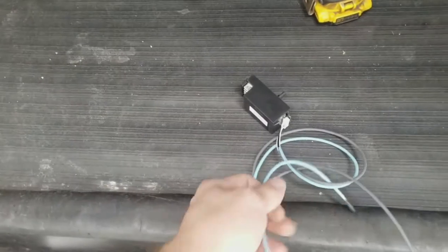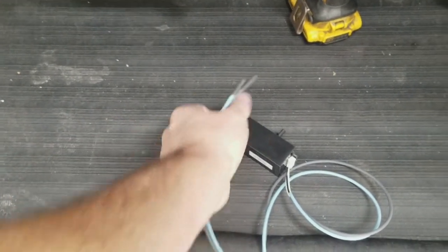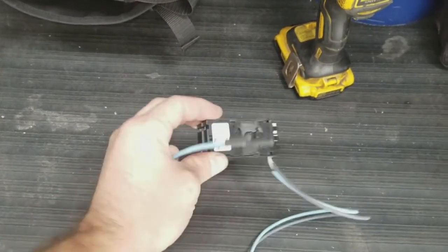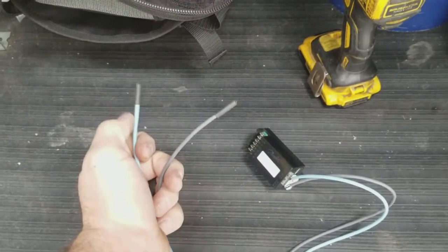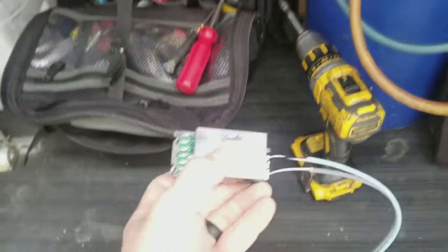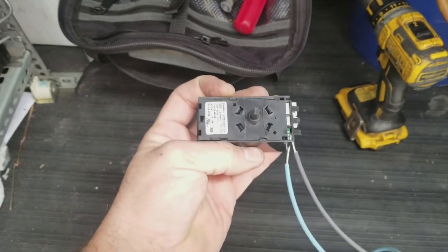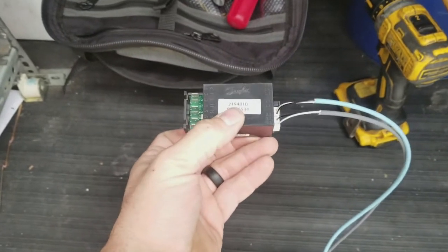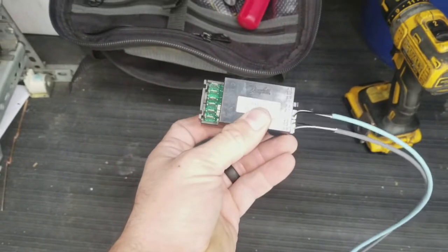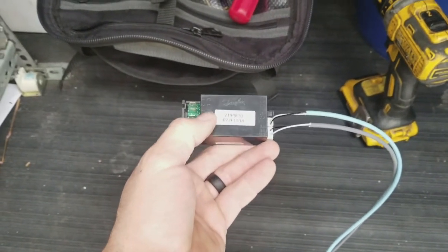This right here is an example of an electronic constant cut-in control. This one has some options — it's programmable by the manufacturer. This is made by Danfoss, and it can be programmed to do all kinds of stuff. You've got two probes: one gets embedded in the evaporator coil, one senses the air temperature. There's no specific function these things absolutely do — it's all based off of the programming from the factory. Some of your options are constant cut-in, always turning on at 40 degrees, and on top of that, it can actually have a normal timed defrost function built into it for extra defrost.